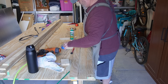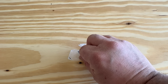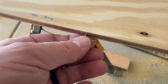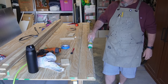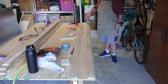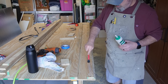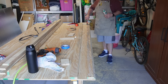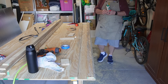Now that I got all my cleats cut, I'm going to glue them and nail them onto a half-inch sheet of plywood. The thing that annoys me about buying lumber at the big box stores is all the stickers and staples they put on everything. I'm going to make the first one flush to the bottom factory edge of the plywood. I got my straw in case I got any squeeze out — you want to make sure you don't get any glue squeeze out above the 45 on your cleat, because when you go to put the opposing cleat inside of it, it won't fit right.